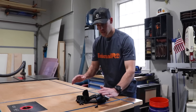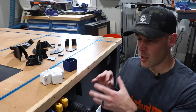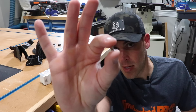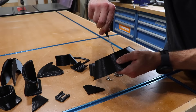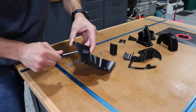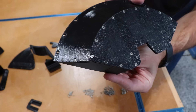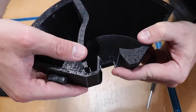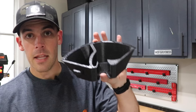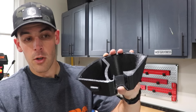The day has come for final assembly. What looks like a random assortment of parts makes up our final product. I broke up the design into a lot of little pieces so I can iterate and tweak things without having to reprint the entire thing, and the entire thing is assembled using tiny little number two screws in varying lengths. We're done with the bottom half of the design — this is obviously where the dust comes in, and you've got this internal baffle located by a cool little dovetail joint. Probably the only dovetail joint you'll ever see on this channel. The baffle is meant to redirect dust out the side where the dust collector will hook up and prevent buildup that would reduce efficiency.